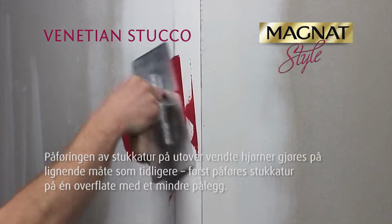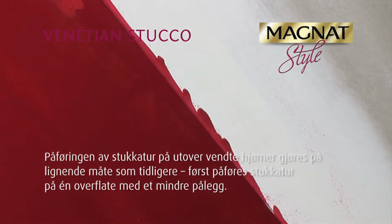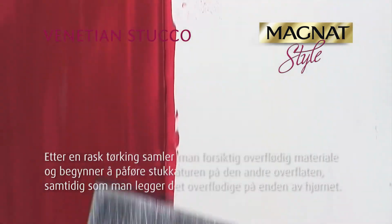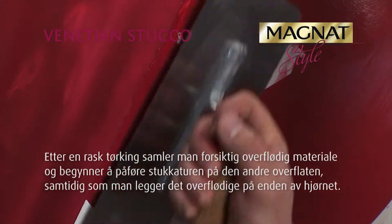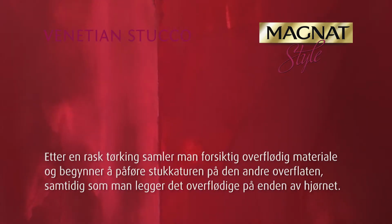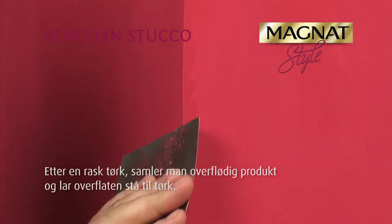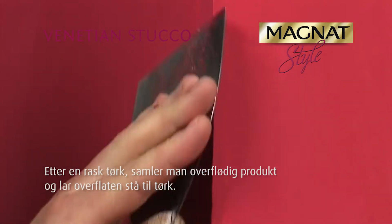Use the same technique when applying the stucco to surfaces with outer corners. Apply the stucco on one plane with small excess of the product at the corner. When the coat has slightly dried, remove the excess and apply the stucco on the neighboring surface, similarly leaving an excess of the product at the corner's edge. When the coat has slightly dried, remove the excess and leave to dry.